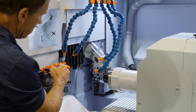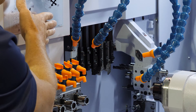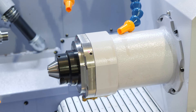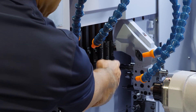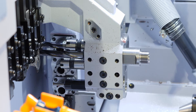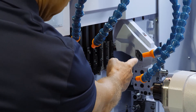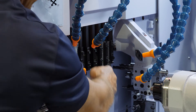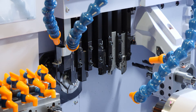One of the other main improvements is the horsepower, like we spoke before. With a larger horsepower — not only on the main spindle but on the sub spindle — we've increased that horsepower by 35% more. As for the very back cross working station, it can be 5 or 6; this machine here is capable of 6. We can also do a 5 station. The tool post here can do 5 tools front and 5 tools rear. The turning tool stations are 6 across on the top rack itself.